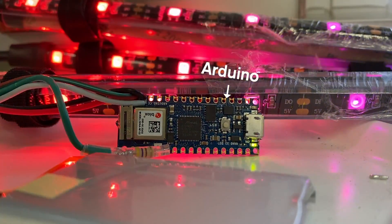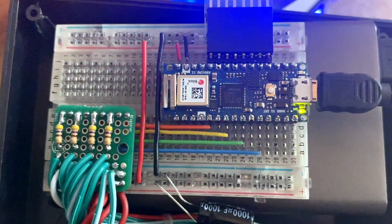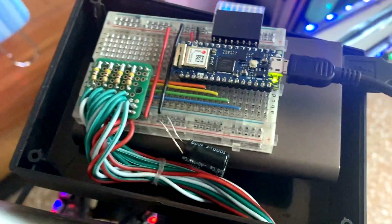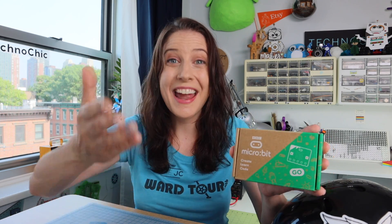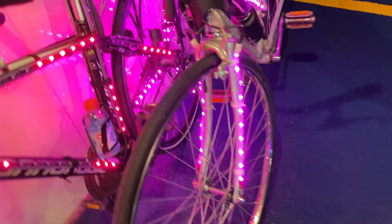You might have heard other name brands like Arduino or Raspberry Pi. My first iteration of this project was actually using Arduino, so I'll put a link in the description if you want to check out that version. I chose micro:bit as the microcontroller for this project because it has a lot of stuff built into it, and most importantly it has a built-in radio. That's going to come in really handy when you want to create a remote control for your helmet lights or other lights on your bike. You can make a controller that controls you and your friends — I'll be showing you how to program the radio in a later video so stay tuned.